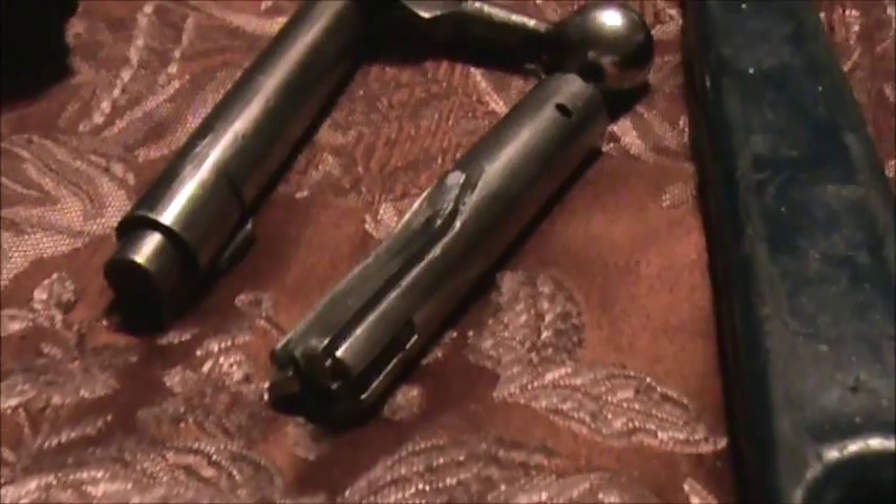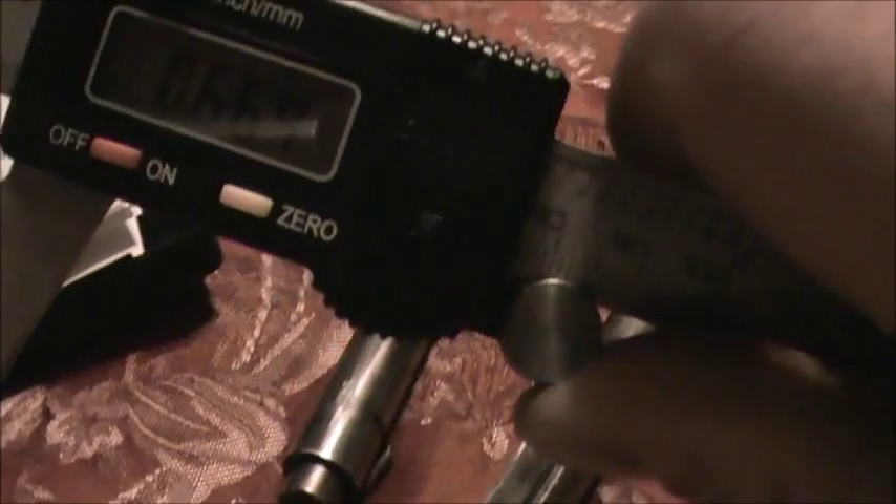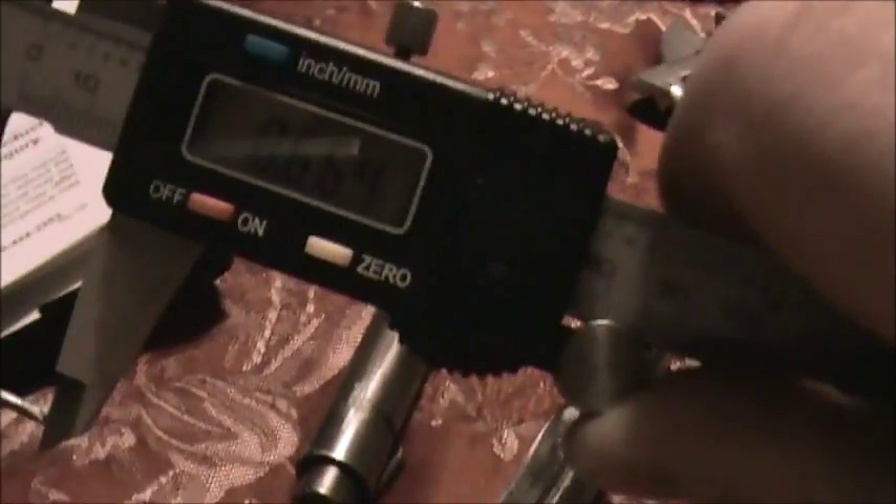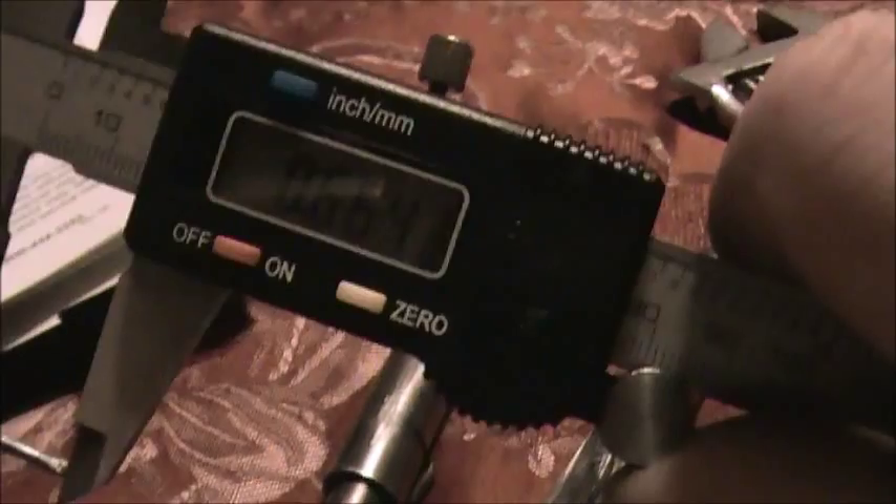Let's go find a drill bit. As far as the length, I'm probably going to make it about 6.85, maybe even 6.90. It can always strike too hard, cause a hard case ejection, or maybe even pierce the head of a .22. I can always take it back apart and take a little off. But you can only make it too short once, so I'm going to make it too long because I don't know what length it really should be.